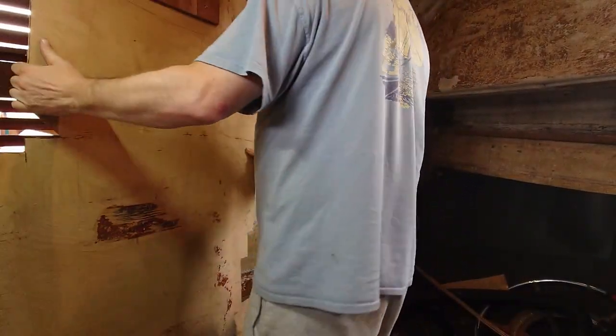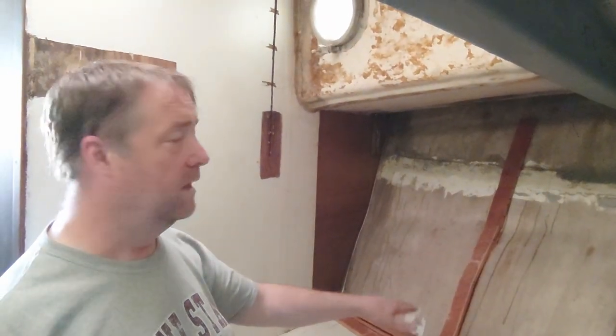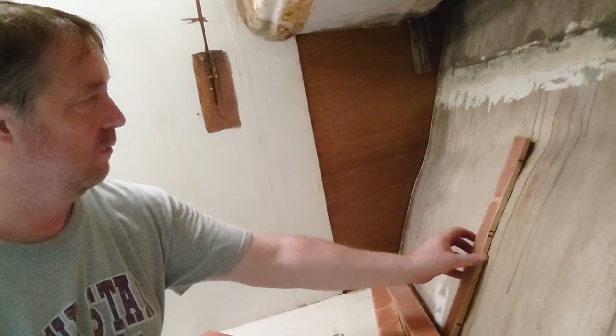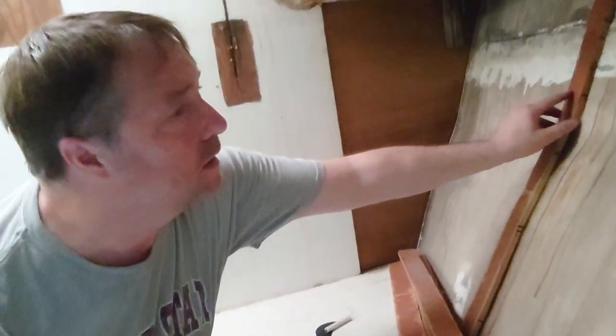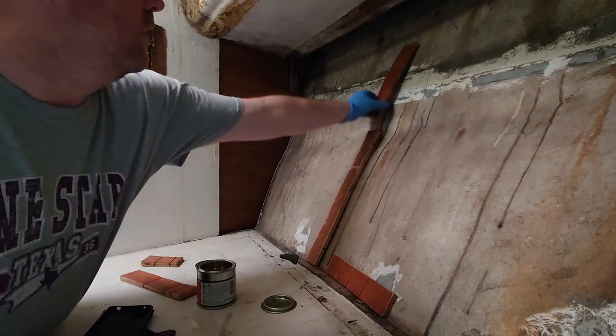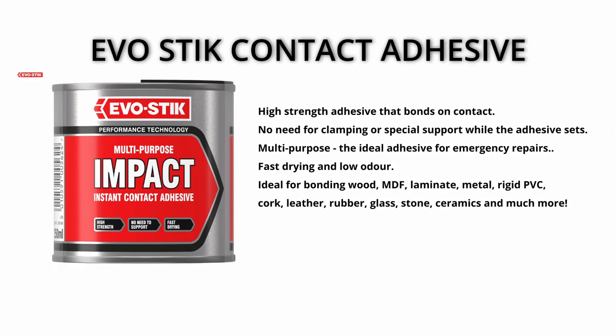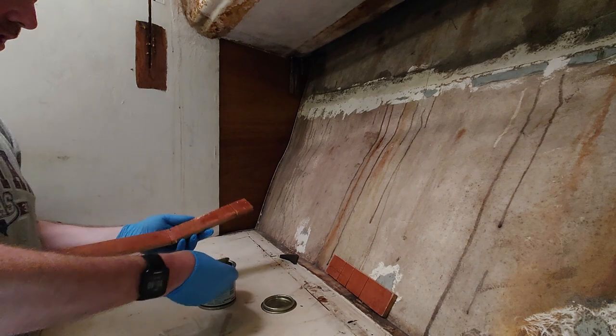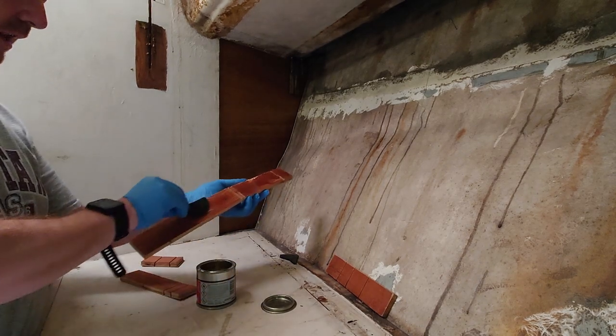There we go — that's the wall done! In order to affix some kind of cladding to this wall — you can see the shape of the boat, the fiberglass — we've got to add some battens. I've cut some bits of stick so they're a bit more flexible, and we can glue them in place. That gives us the advantage that when we come to put a sheet of wood on there, we've got something to screw into, and the gap will be foam insulation. I'm using an impact adhesive for first fix to hold the batten in place immediately, and then I'll go round the edges with two-part epoxy later to give it strength. I've ladled that all over there and it should just go in and stick.